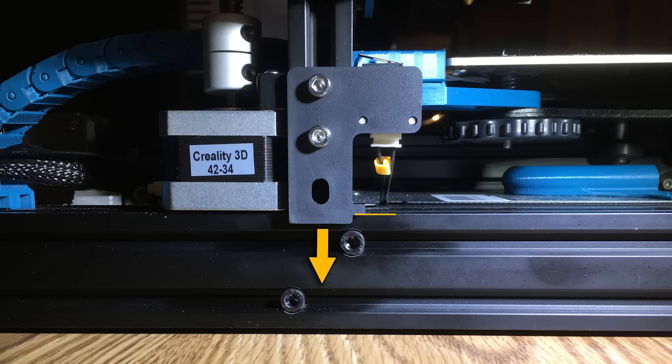Move the end stop down — say five millimeters as a test — then tighten it up. Don't worry about over-tightening; you're using steel screws and steel nuts so you don't have to worry about stripping anything. Once it's moved down, go back to the start of the video and start over. What you want is for the springs to be under enough tension that they keep the adjustment wheels from moving freely, otherwise those wheels will move during the print and your bed will constantly go out of level.